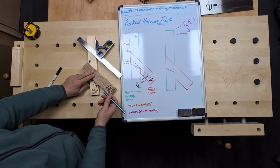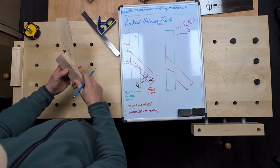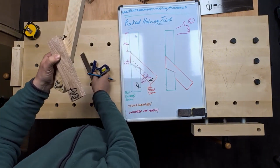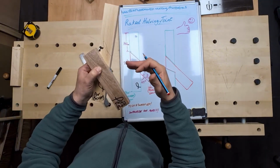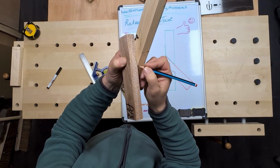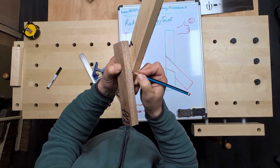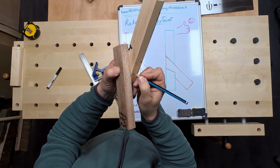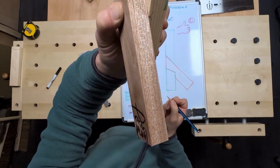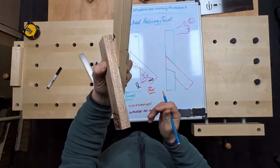I'm going to have to look over this. I'm going to try and get it in the camera that where these two pieces of timber join up, if I lift this up, when I lift this one up, I'm holding it in my hand in here. I'm holding that there and they keep slipping about and moving around. If this is fixed on the bench, it's easier to do it, but I need to show you for the video. This area here, where they meet, this is where you want to mark that and that on both pieces. If we've got that mark on both pieces, let's put a little arrow to that one and a small arrow to that one. Can that be seen? That's what we want to do. But it's far easier if you're able to hold it down on the bench and use some clamps.